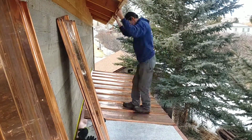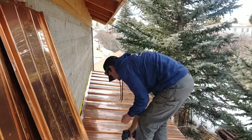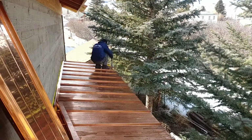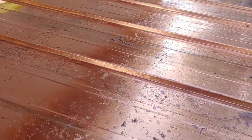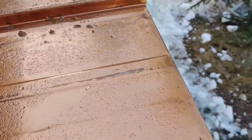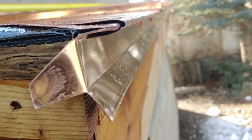This flat roof, it's almost flat. I put ice and water, then dry in, and then this Energy Star product on top. So it's never going to leak. Never. This is the tool that crimps everything down. Wish I didn't have mud on it. No fasteners here, because this is how I did it. It's bent over a drip edge and crimped.